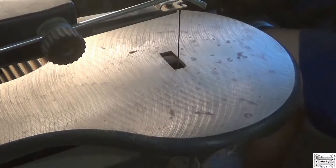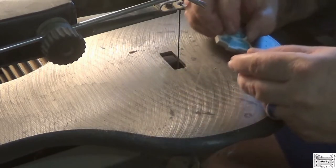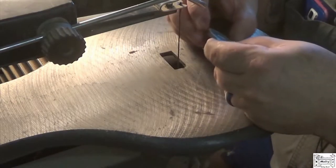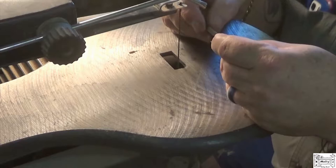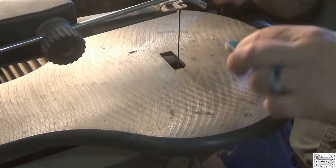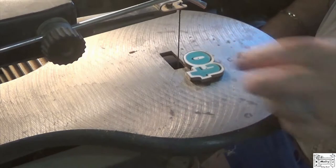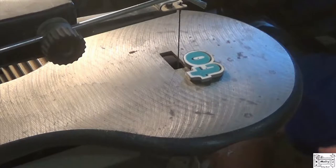Alright, now the blue letters, I'm not going to be able to scroll saw these out because I need a quarter inch hole in here to saw the middle out, and because of the saw blades that I have to use. So what I'm going to do, I'm going to take this apart, of course, because the bottom is fine. I'm going to take this and tack them with double stick tape or something to a piece of scrap plywood, probably these two, and then I'll just cut these out with a router. I know I can do that, so that'll come later.